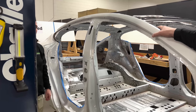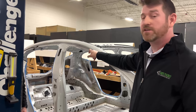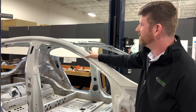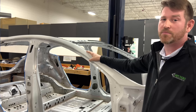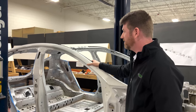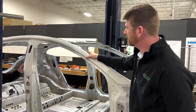In Tesla's defense, they do have relatively small flanges. Some other vehicles get around accuracy issues by increasing the weld flange — probably somewhere in the 12 to 14 millimeter range here by the look of it — whereas a lot of vehicles are sometimes in the 15 to 17 millimeter range because they cannot dial that process in. So they pay a weight penalty on the door aperture. On every vehicle that goes out the line, they're costing themselves a little bit of weight, but that's how they get around not being able to control that process very well.